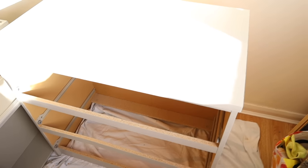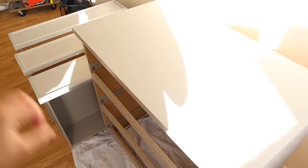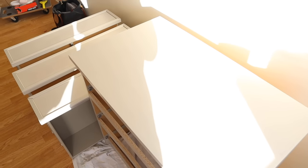Pretty much all we're gonna do now is we're gonna go in with a sander at 220, really lightly, just dust over the top of it, over each section, and then we can apply a new paint coat. It takes between 2 to 4 hours to dry, so I'm gonna crack on with that now, and then after 4 hours, I'm gonna do the final coat and let it dry, and then that'll be done for today.